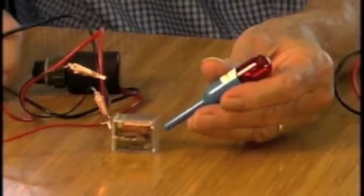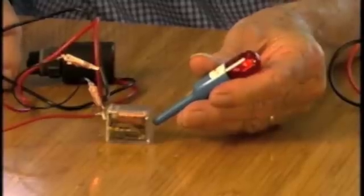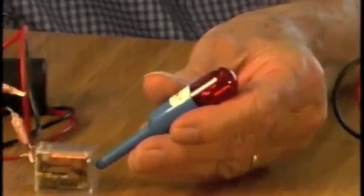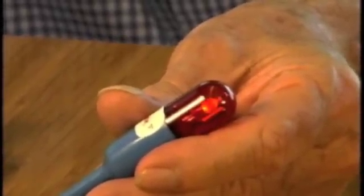Now, I want to check this relay and see if it's energized. You see that light come on? Right there. That's what it takes — that's how long it takes, just a second. Now, once you get the spot on all these little ice cube relays, you know where to go on each one. I've checked it in one second. What it normally takes with a voltmeter — and still, even if you get a voltage measurement, you don't know if there's current through the coil.